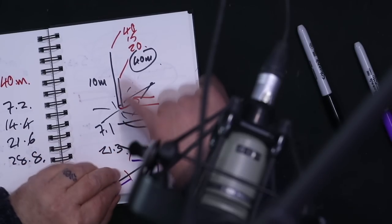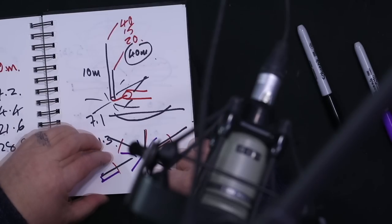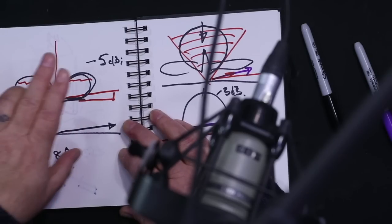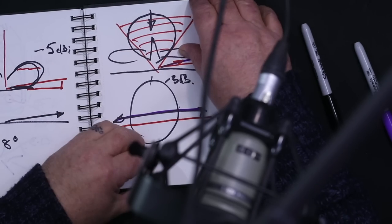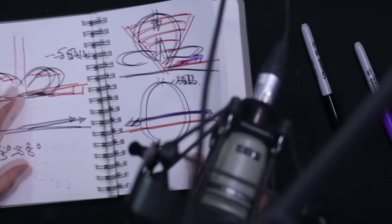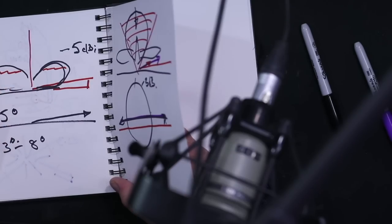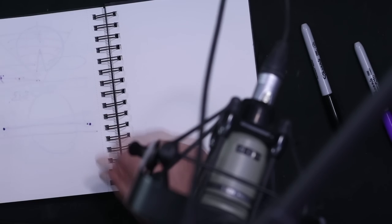We took our dipole and converted it into a fan vertical. For radials, don't worry too much — just put a few out and see what happens. We did a bit on the radiation pattern and benchmarking at five degrees off the horizon. If anyone wants, I can show you how to build a basic vertical in antenna modeling software — it only takes two or three minutes.